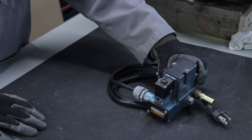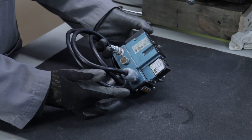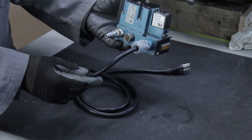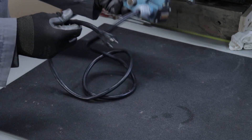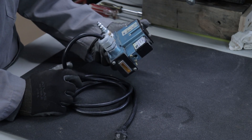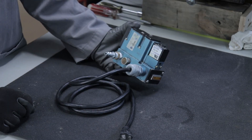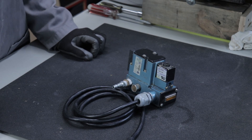This is another example of something repurposed off an old piece of equipment. The valve's in good condition but it's way older than you think — dig around a little bit to find information on it. It works perfectly fine though. The other reason I chose it is because the solenoid takes 120 volts, so I've just got it wired up to a regular plug-in. This works perfectly with my control setup — I plug it into the outlet operated by the foot pedal and it turns this valve on and off. The solenoid when it's on draws next to nothing, so the overall load works nicely. It's great for what I'd still consider a prototype.